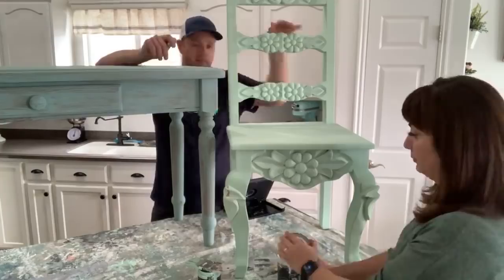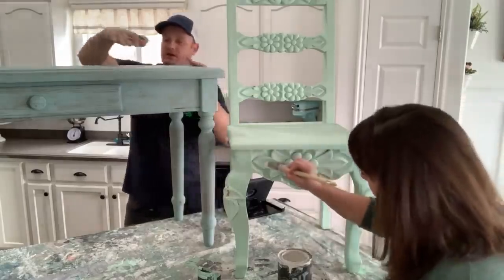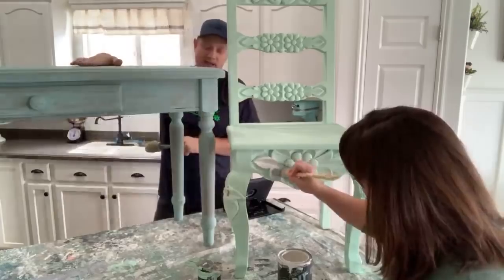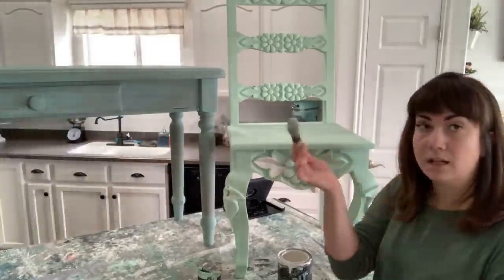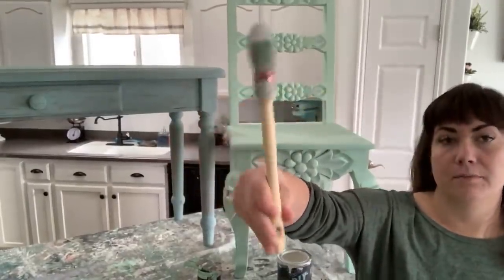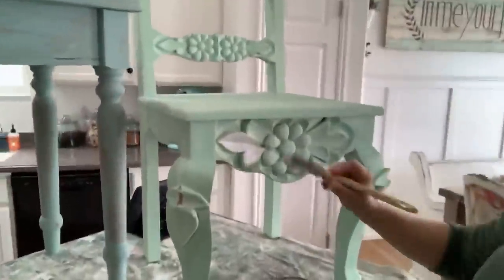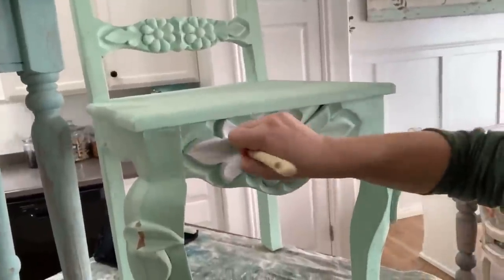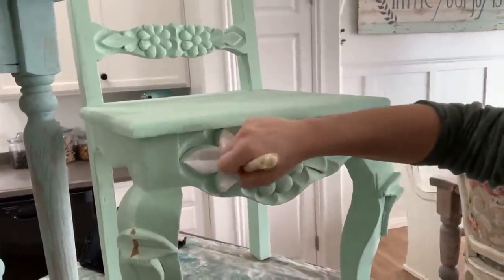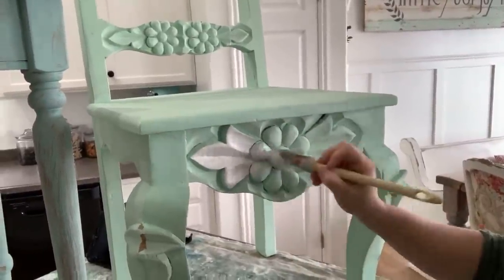The chair is Mint Chip — Jamie painted this off camera the other day with Farm Fresh, and it's a little streaky, just one coat. We didn't do any sanding, just wiped it down and painted. I'm taking my French round — this is the old one with the plastic handle, but they now come with a wood one. I use this to two-tone stuff; I just paint it and when it's all done I'll wet distress it, which makes the details pop.